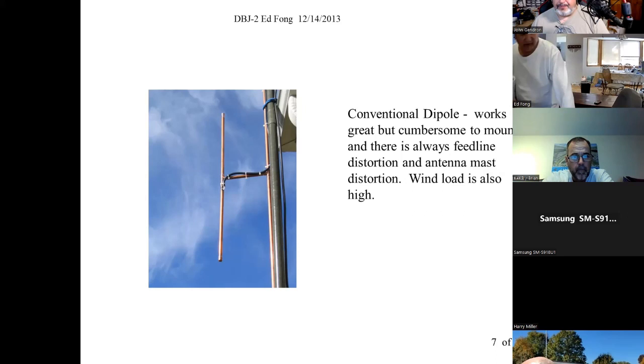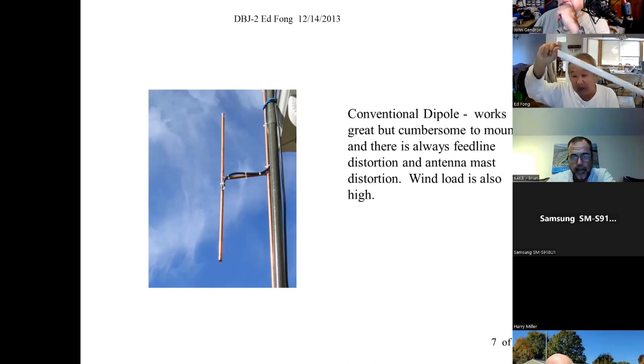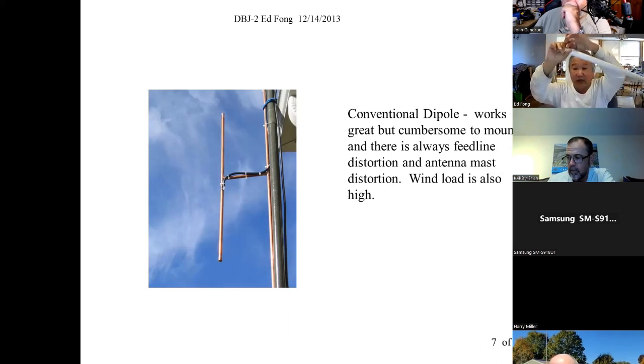Here's a good example. I can hold this up vertically really easily, but I can't hold it up horizontally. The R cross F on this is 0 because the radius is 0, so it's only a vertical force. But as soon as I put this on the side like that, it's much harder to hold up. Much harder. It's R cross F: the force of gravity times the distance. The more distance, the more force it pulls down, so it puts tremendous stress on this node right here.